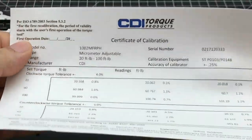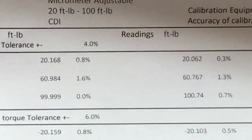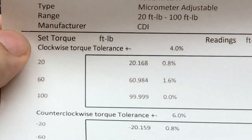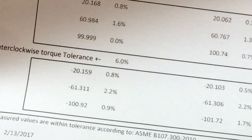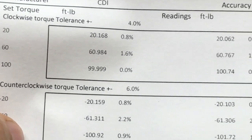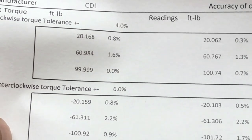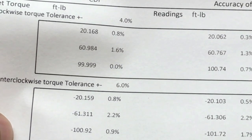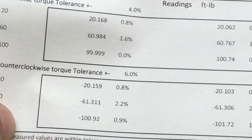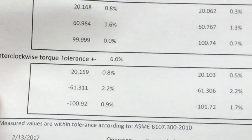Here's the certificate of calibration. You could see that they do several tests. They set the torque at 20, 60, and 100, and they test it in both clockwise and counterclockwise. And you could see that the readings at clockwise at 20.168 foot-pounds, it's at 0.8% accuracy, and then at 60.984 foot-pounds, it's at 1.6, and at 99.99, it is at 0.0% within spec, which is actually pretty decent,